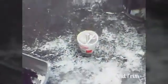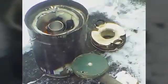And my lid broke. It didn't break, but it's chipping apart. That last heat was too much. And I'm going to try to do all the aluminum on low heat, or low air, because I kind of don't want my crucible to explode. But alright, let me set you guys up and enjoy the show.